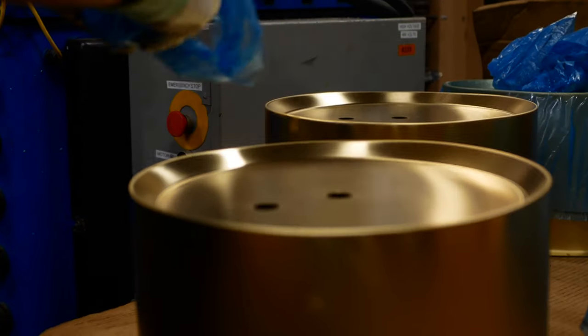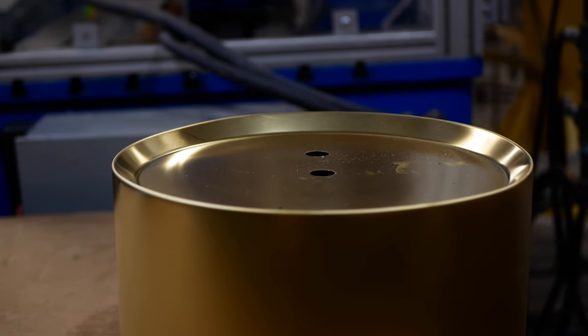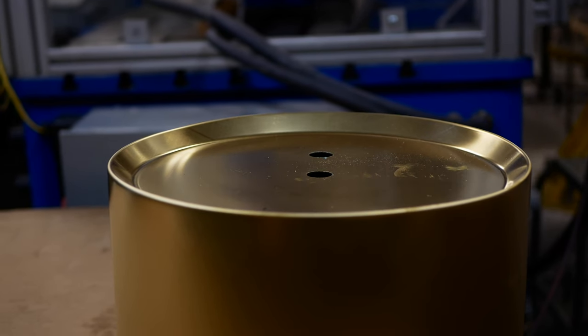Hydroforming gives you a lot of unique advantages that other forming methods don't have. We can, for example, pre-polish the blank, coat it with plastic, form it up with the plastic covering the polish and leaving that shiny surface, so we can peel off the plastic after it's formed and you get a nice finish — not 100% polished, you'll have to touch it up, but it gets you about 90% of the way there.